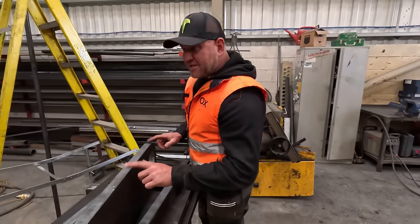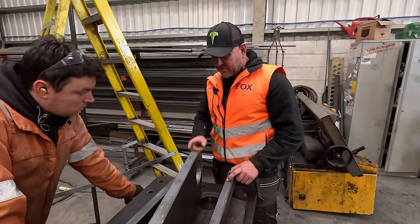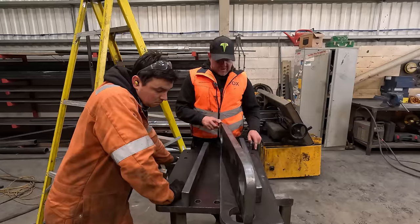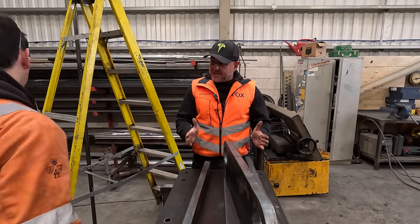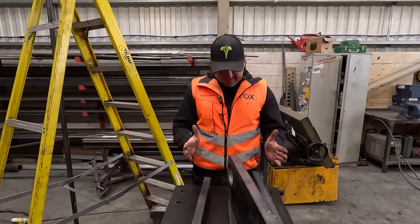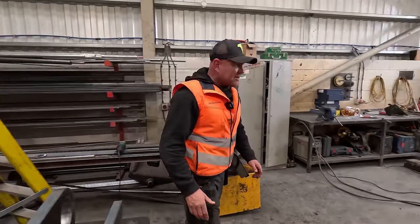Right, Cal, they're pushing for this now, so it's just been passed on to me, yeah? But you can't put that together without the pins, right? So I'll go and get the pins now. It's 420 to the inside, so I'll do it like 423 actually, because a quick hitch is about 410 mil, yeah? Right, we'll go and get the pins from my little pal.